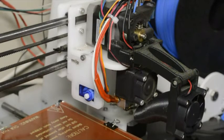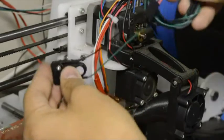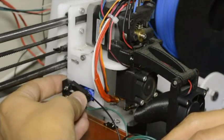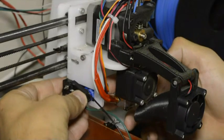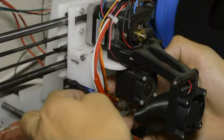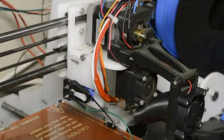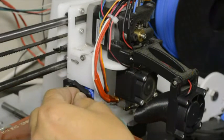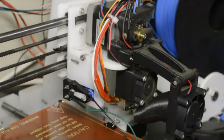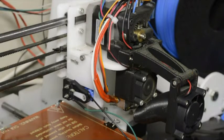When you switch it on, you'll hear the servo go to the zero position, or the resting position. Now it's ready to connect the arm to the servo. We'll connect it in the horizontal position from the back, pushing the white arm of the servo onto the output shaft, then fix it with the small screw that came with the servo's fixing hardware.